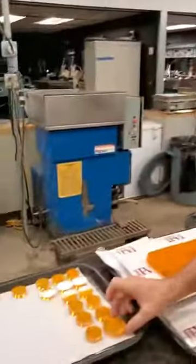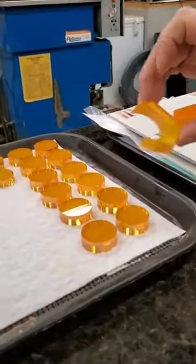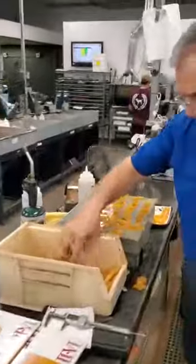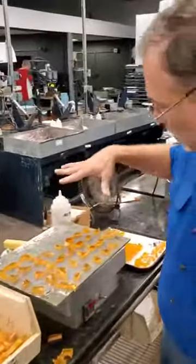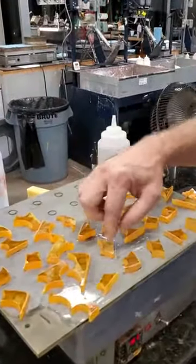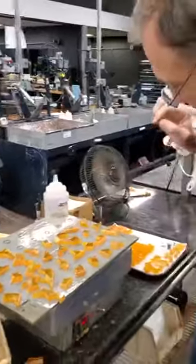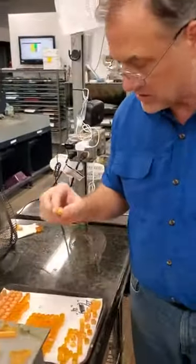Here's an example of how we core a large optic, and we end up with this as a scrap. That goes in a tile like this. From there, we wax it onto a plate, which is lined up for doing a smaller optic with beeswax. And then when we core it out, we end up with little pieces like this.